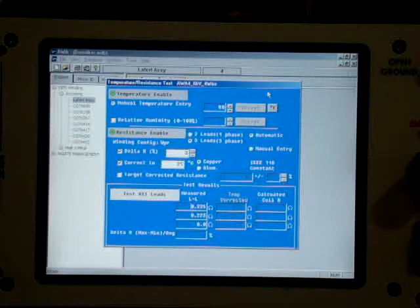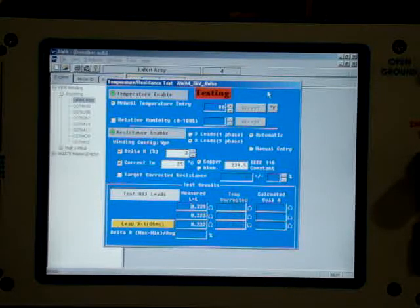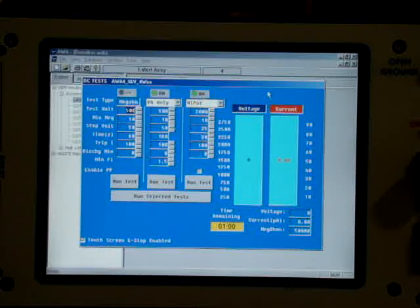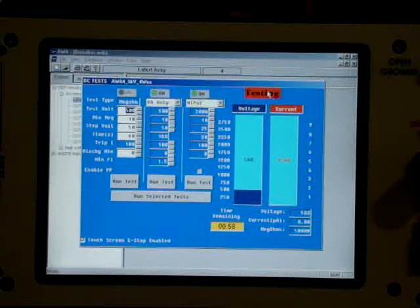So far, all balanced as compared to the original. It's now doing the third phase. With that test complete, it will now run my megger test for one minute as soon as it brings the voltage up to the required value of 500 volts.